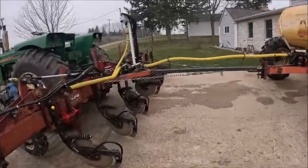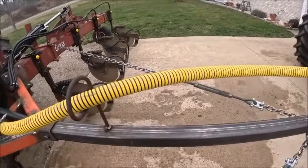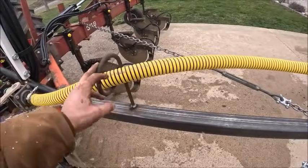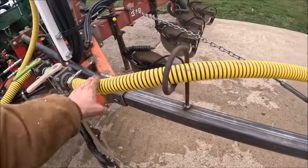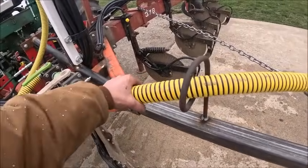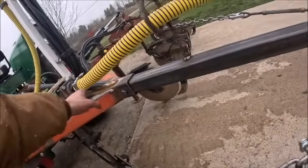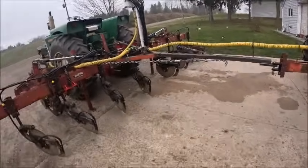The other thing I'm going to do is throw some primer, possibly some paint, on the tongue. But I'm going to cut this hose holder back off and shorten it to get rid of this steep dive right here, because it's pulling up on the coupler a little bit, and I'd rather not have that. I'll take whatever I need to do to get it roughly in line with this, and I'll measure it before I take it off. But anyhow,